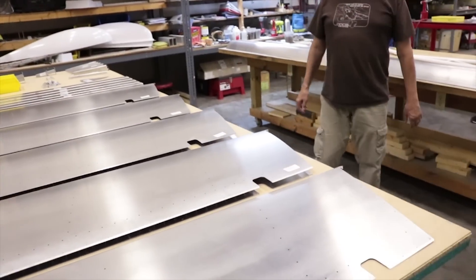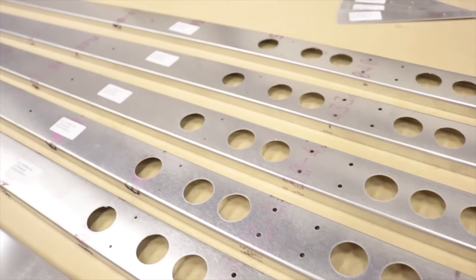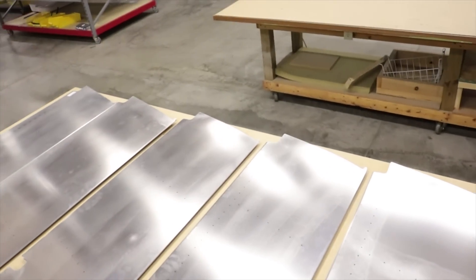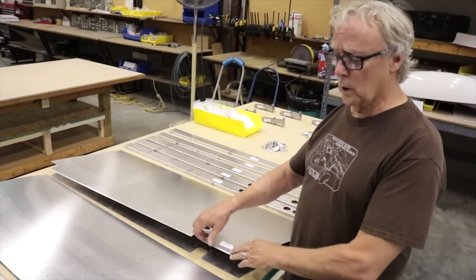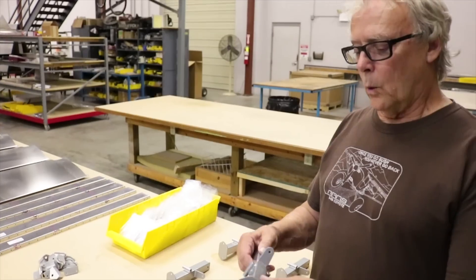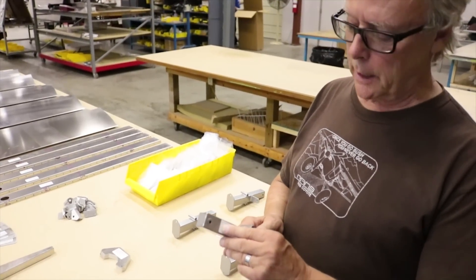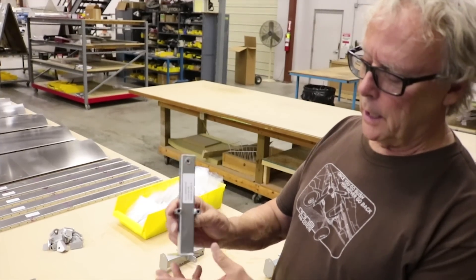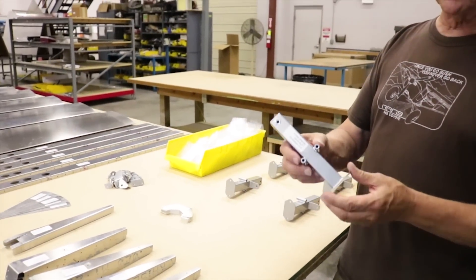Over here, it looks like rudders — are you about to do a rudder workshop? Tomorrow we're having two rudder workshops: one in the morning and one in the afternoon, and we'll be doing a total of ten rudders. We've seen a first-timer average about two and a half hours on the rudder. We used to send it out with the curve already in it, but since the builder has to do that on the elevator too, we moved that step to the rudder workshop. One thing we say about the Outbound is you really don't have to paint anything — you can build the entire aircraft without opening a can of paint. All the steel parts in the kit come either painted or powder coated. This little assembly is a powder-coated rudder horn that attaches to the spar, and the actual horn bolts onto it, creating an assembly ready to go — no messy paint jobs.